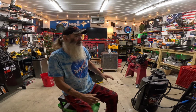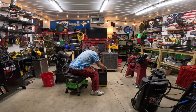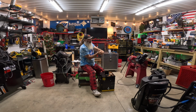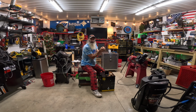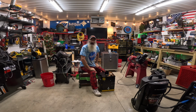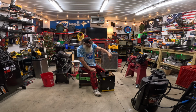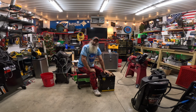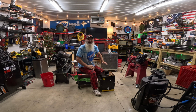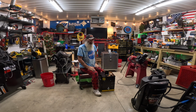What he had was this stationary machine underneath a belt sander, and he would sharpen his knives, or grind whatever weld he needed to grind down, in a stationary position with this belt sander, and the sparks would come down. He had fabricated a pipe on top of it, with a funnel on top of the pipe, and the sparks would go right down inside this machine. It has a spark arrestor and a couple of filter systems that collect the debris. Well, I wouldn't say all, but most of the debris, let's say. And so that sparked my interest.